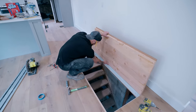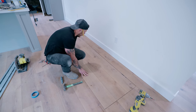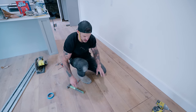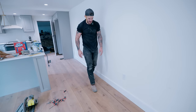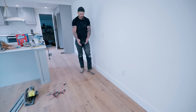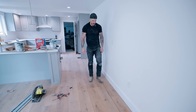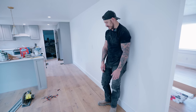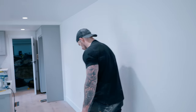To make it a smoother close, I trimmed off about half an inch but it made me put a bevel right on this corner so it doesn't catch on this little lip. So far we have a smooth opening and closing door. Celebrating the good things first — the lines line up perfectly here, I'm happy with this gap here. The only section I'm not happy with is this one area — there's nothing we can do about it, maybe with different door hardware. It's functioning, opens and closes smoothly, it just has about a quarter-inch groove there. You've got to pick and choose your battles. I think this is the best I can do — if you have ideas or hardware you'd recommend, let me know.